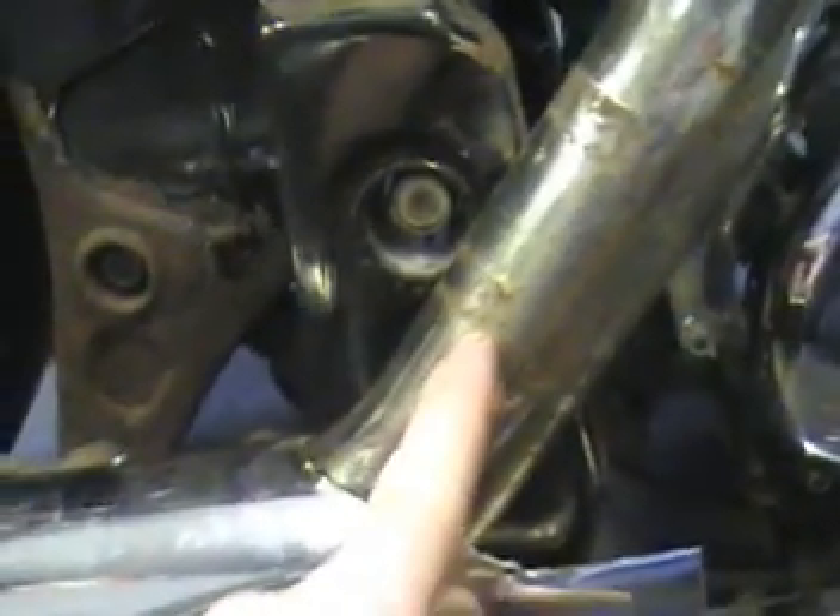Just a little update — I've been working on it for a little while now and managed to get the exhaust on, but I've come across a couple of problems. Mainly, this exhaust stud is sheared, so I can't do this pipe up correctly to the engine face. That's going to alter where this actually sits. I've got this tube now roughly in place.